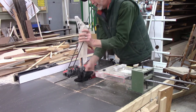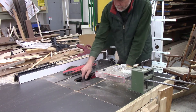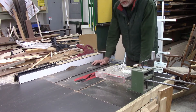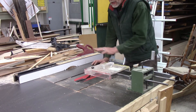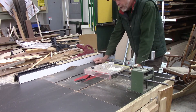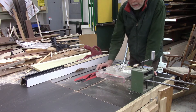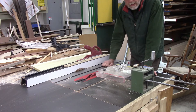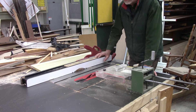Here at Royal, 95% of the time we are going to use the riving knife. We're going to use this guard right here — it does a good job of protecting us, I can easily get it out of the way, and it doesn't require taking stuff in and out of the throat plate. So: I have a blade in here, this is a rip blade, and I have a riving knife that sticks up behind the blade to keep the piece of wood from coming away from the fence and causing a kickback. The fence is not optional — I cannot freehand cut on a table saw.